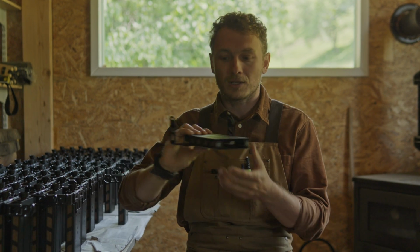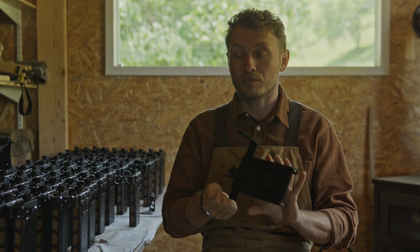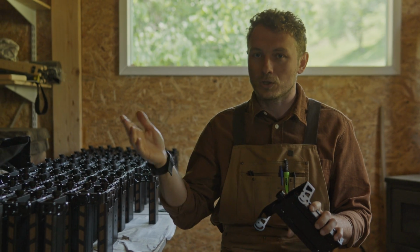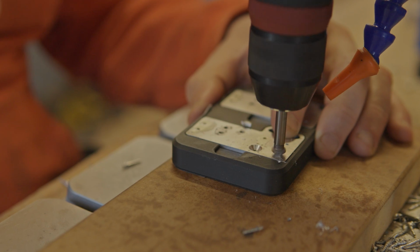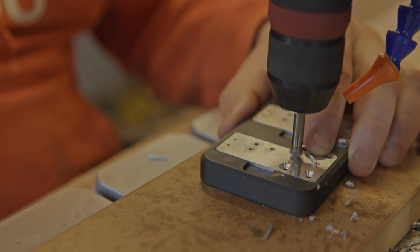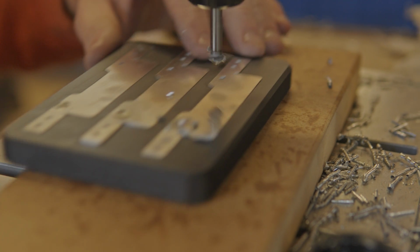This worked really well, and the company that makes all of these aluminum pieces for the camera got the green light to cut 200 pieces of these cameras. There was a timeline that they agreed upon on which they would deliver, and the first step was they cut the raw material into sheets, upon which we take them to our workshop and do post-processing, which I'll show you in some video clips of us drilling chamfers and tap holes and threads, stuff like that, which is necessary for holding the camera together.